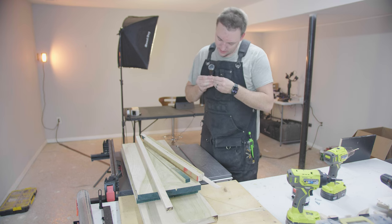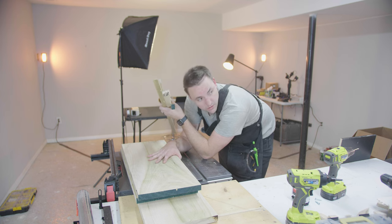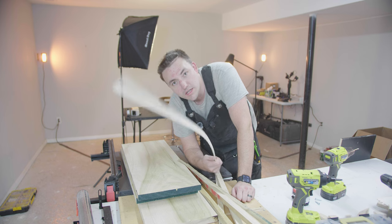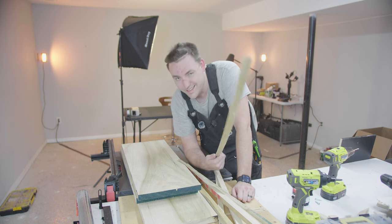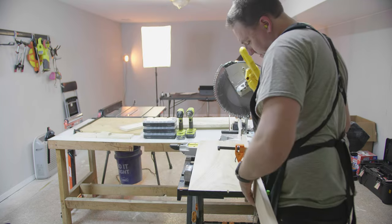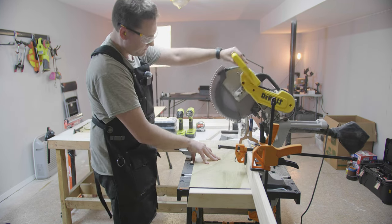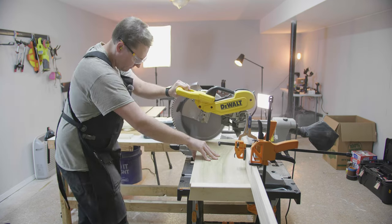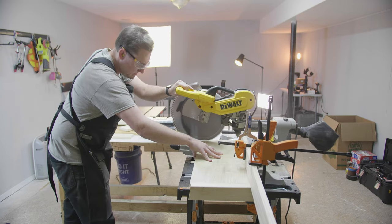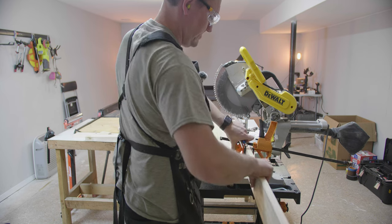Ow — splinter. Booty sauce. All right. The boards now have flat tops, bottoms, and edges. So now I'm going to take them over to the miter saw and cut them to correct length. For the legs, precision in this section is really important. However, for the top of the bench it really doesn't matter — it's going to be as long as it is, so I more or less just trimmed off the edges where the screw holes had been and called it a day, meaning I didn't actually need the extended fence or stop lock for that piece.